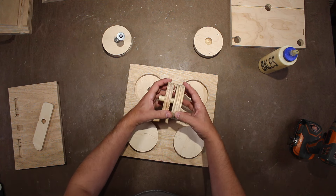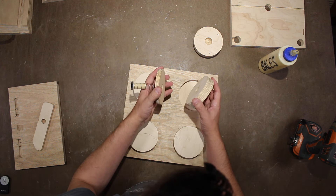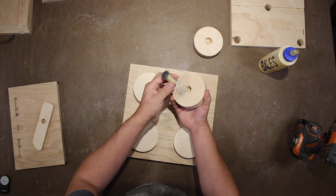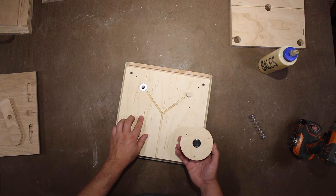The locking stud is an inch and three-quarter thick, with the center dowel extending through the base plate. The light switch stud is an inch and a half. This holds five-eighths; this holds three-quarters. That creates a positive stop or a shelf for the spring, which keeps everything under tension. This is the inside view.